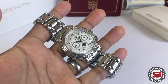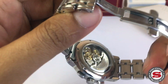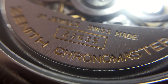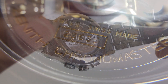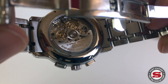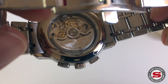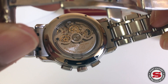The movements all have serial numbers, as required for COSC certification, and the rotors also have to be numbered. Looking at the actual movement, we can see it has been numbered — my rotor is numbered 23,635 — so quite a few of these were made. The rotor itself is bi-directional.